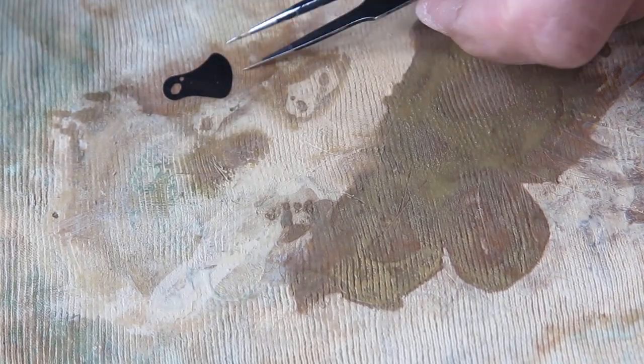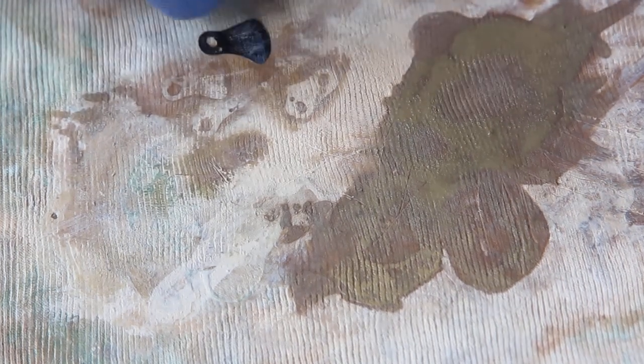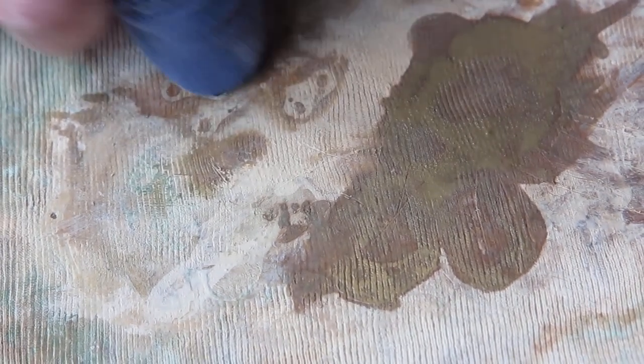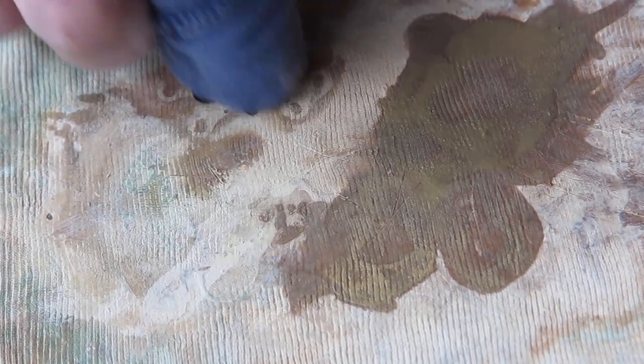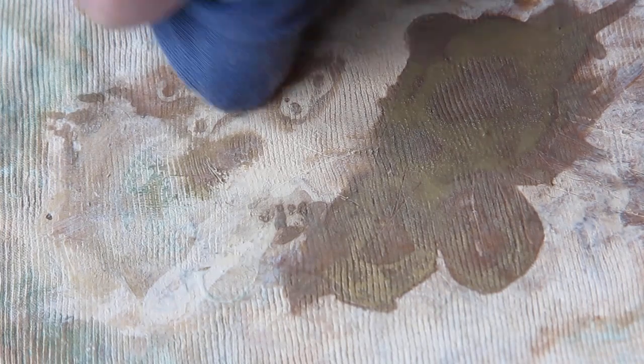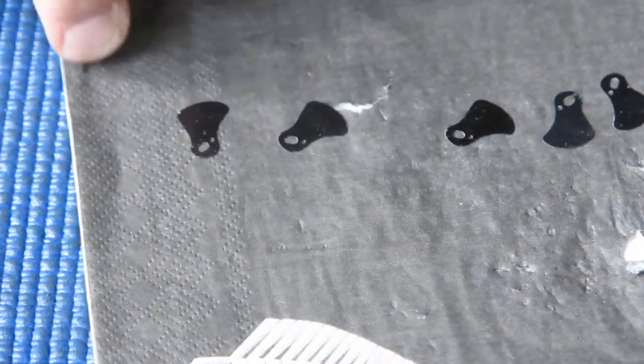Certainly polishing shutter blades like this is not something that I would need to do for every shutter that comes my way. Generally speaking, it's simply enough to clean the shutter blades. But if there's any sign of corrosion, this camera in particular, it showed considerable sign of having been stored somewhere damp. It tends to show up on the shutter blades. And then that can be a major nuisance. And then they certainly have to be polished.